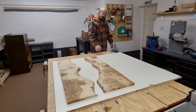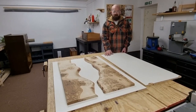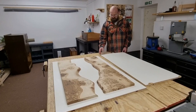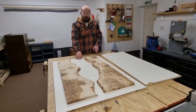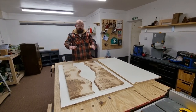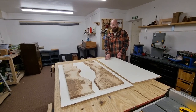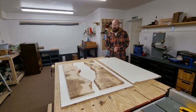Now the pippi oak has been cut to size we're going to start making the mould. We've got these old wardrobe panels which we've dismantled from an old wardrobe in our house, took all the hardware off them, and we've got the biggest panel here with the two pieces of pippi oak placed on top. Now we need to build the frame to go around the edges to secure the epoxy inside. I'm going to rip these down on the table saw and then put pocket holes in them and attach them to the correct size that we need.